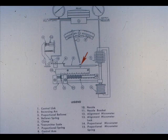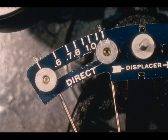The increasing pressure in the feedback bellows causes it to expand, moving the right end of the control arm down. As the right end lowers, the left end raises because of the floating pivot at the control link. The left end of the control arm restores the flapper and nozzle to a throttling position — the system is balanced again, now with the output at 50%. The reversing arc is adjustable from 0.5 to 1.4. If we have an interface of 1.0 and 0.8 specific gravity material, the effective specific gravity would be 0.2.